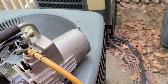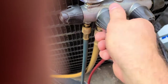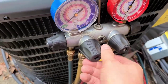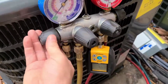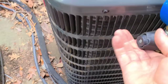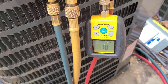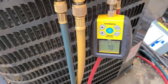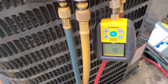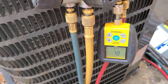I've got my vacuum pump set up and I'm running my micron gauge meter on it, so I open everything up and make sure everything is pretty snug by hand. I'm going to start it up and we'll see how it pulls down. This is on the floor of the apartment so it's got a little ways to go.